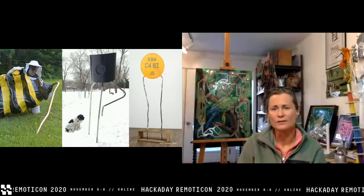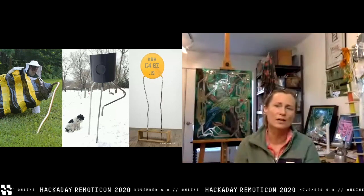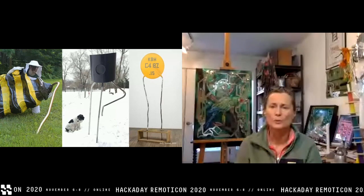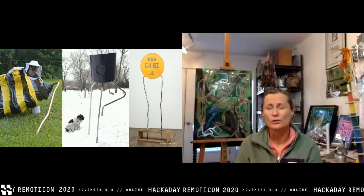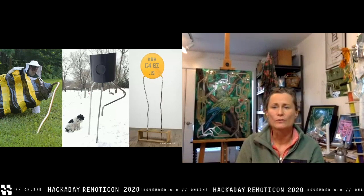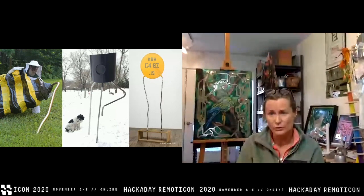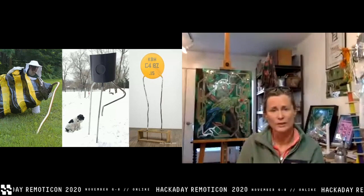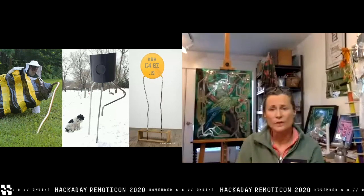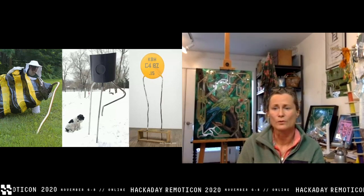I've sculpted numerous sound- and light-generating insects because I love the way they look and sound when you have enough of them to make a landscape or soundscape. In the upper left I made a kinetic sculpture of electronic bees with tiny pager motors and mechanical springs — the nice thing about metal springs is you can use them as part of your circuit and they're still bouncy. Also shown are two approaches to electronic moths: the white moth is entirely electronic, built from PCBs shaped like wings, and the yellow moth has a circuit board body but fabric wings. Both flutter LEDs using a shift register.